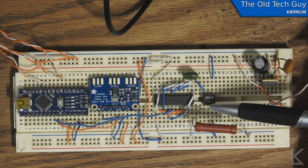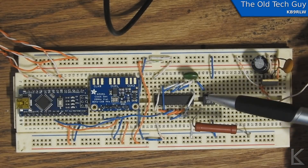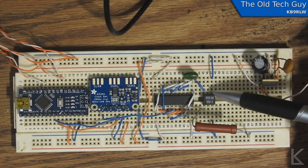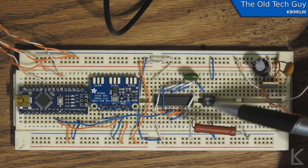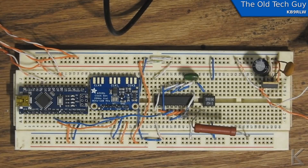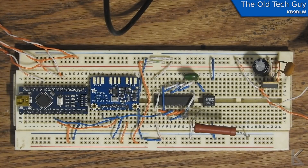It's a nice little DIP package, four pins. Pin 1 is up in the corner. The secondary is on two pins and the primary is on the other two, so you just ground one of each and then connect your input and output. That works. I'm going to update the schematic today with that information. A lot of people are just going to buy the part because a lot of people don't like winding toroids — although it's not that tough.